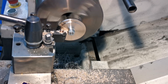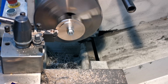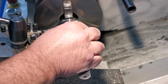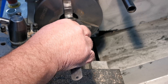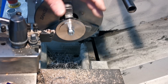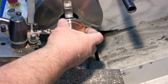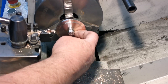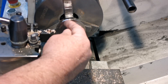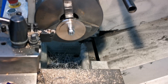A little bit more. Alright, that's one-sixteenth there — so that is machined to size now. I'll mount that in the milling machine and take that middle bit out. Then we'll be doing the holes on the pitch circle diameter to bolt that onto the cylinder block. I'll get on and do the second one.